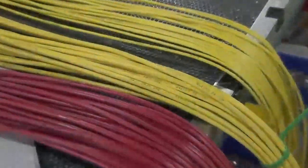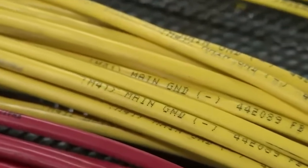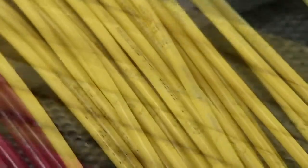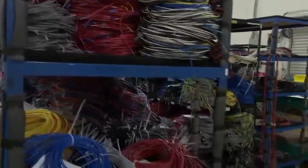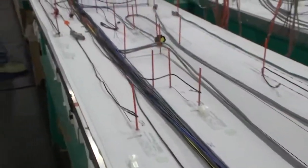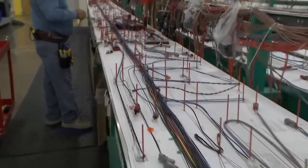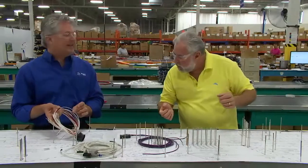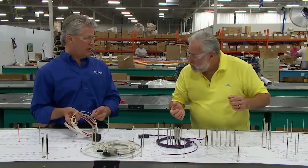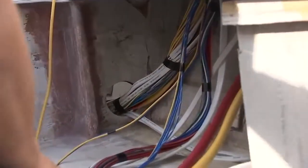I'm noticing that you're printing every foot the actual circuit that it's going to, and that is so beneficial — not only for the installer at the boat plant, but also a technician down the road or the owner of the boat. You know exactly what wire is for what. The color code identifies the general circuits, but sometimes it gets more specific. What we do to solve that is print on the wire the exact circuit function of that particular wire, so no matter where you are on the boat, you can tell exactly what it is.